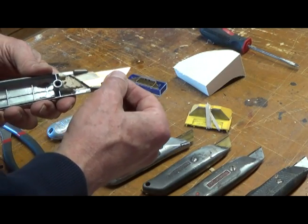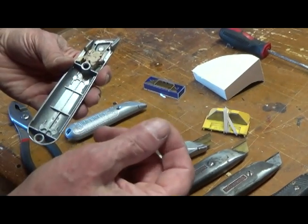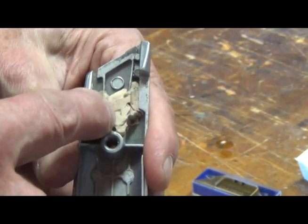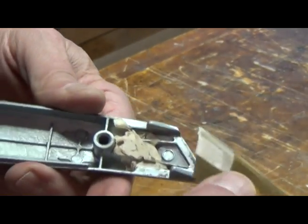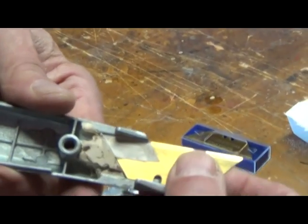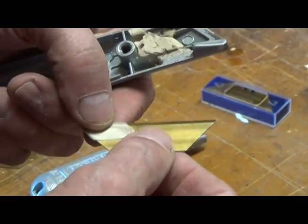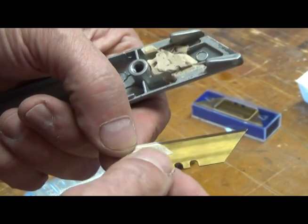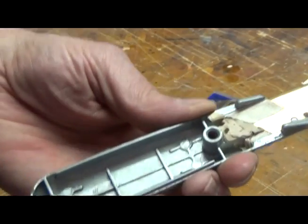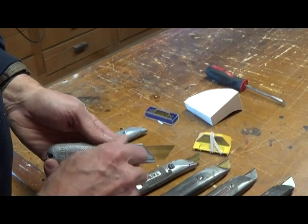In doing that, it left this blade kind of wobbly out here because it was only held by that one knob. So what I did is I took some two-part moldable epoxy — plumber's epoxy or whatever you call it — and I just stuck a wad of it down in there, then forced my blade down in there so it comes right up against that and locks the blade solidly in place so it will not move. And another thing I do when I put a new blade in is I always put a piece of masking tape over the cutting edge that hasn't been used yet — that will just protect it that much more for the next time you use it.